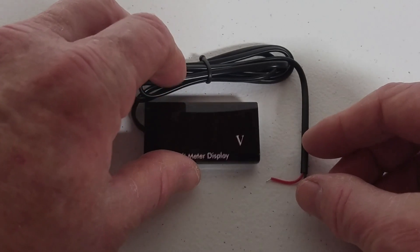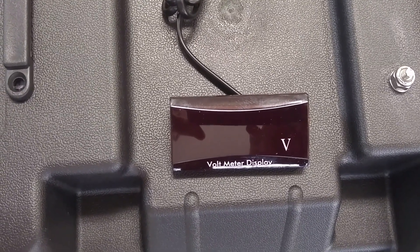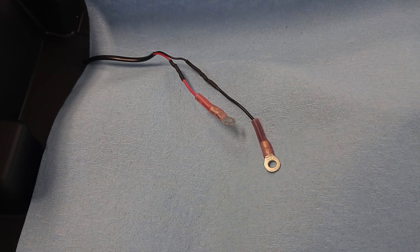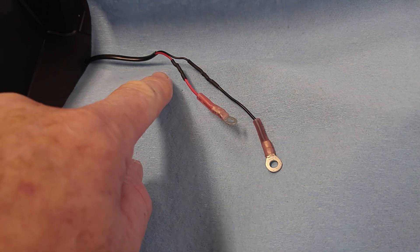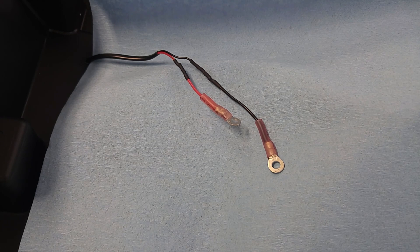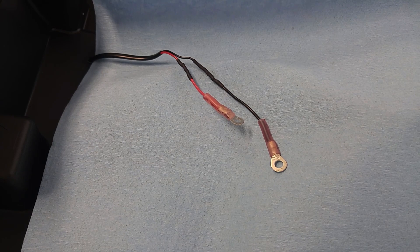So that's why I'm going to be using this one on my battery box, and I'll show you how I did it. I decided to mount it on the top of my power station battery box, and I marked with a marker behind the voltmeter where the wiring needs to go through the top of the box. Because the wires from the voltmeter were very small diameter, I needed to splice in some larger gauge wire that would fit using the ring connectors. So I cut the red and black wires, stripped each end, wrapped and soldered them together, then used marine heat shrink tubing over the connection, and added marine heat shrink ring connectors to the ends so it would fit on the fuse box in the top lid of my power station box.